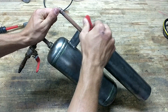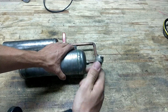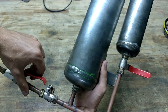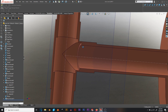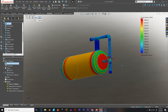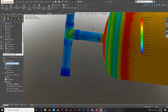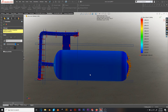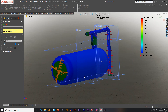And we're done! Using a standard quick-connect fitting, I filled up the air tank with compressed air. My particular compressor only goes up to 8 bar or 116 psi. A quick stress test in SOLIDWORKS shows that in theory, at least 500 psi is required to plastically deform the copper tubing, and 1000 psi is required to plastically deform the steel tank. A lot more is required to create a rupture, so 116 psi should be very safe.